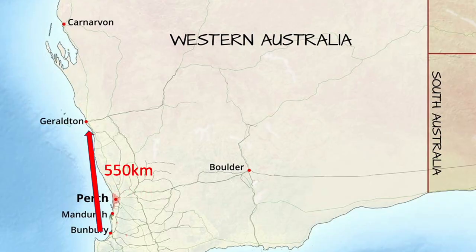A lot of people say there's no repeater around where I live, or I'm out in the middle of the bush, so it doesn't matter if I use one of those channels. Well, that's where you might be wrong, because under certain weather conditions you can get ducting or tunneling, where a UHF CB transmission can actually travel a lot further than you would think — a bit like the skip we were talking about with the 27 megahertz CBs but in a different way. I've been in Busselton and spoken to people in Geraldton using ducting on a UHF CB, so it's definitely something to be aware of. You might be far away from a repeater but that doesn't mean it's not picking you up and retransmitting you across an entire large landmass.